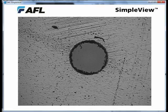This is the end face of a commercially made connector on a patch cord. As you can see, the polishing polished only the fiber — the connector itself, the ferrule, does not appear to be polished. And there's a lot of hackling or breaking along the outside of the fiber. It looks like this fiber was not properly polished during the first stages.